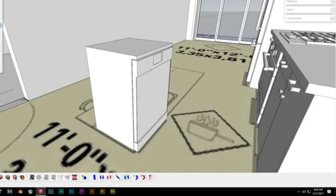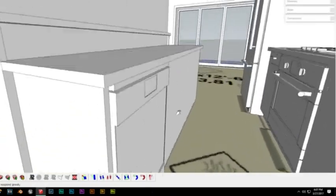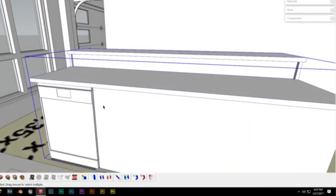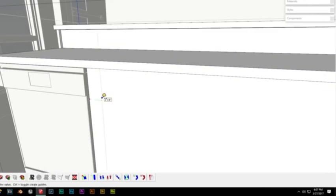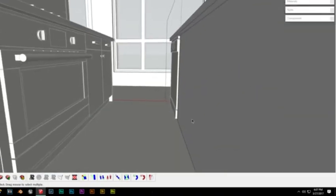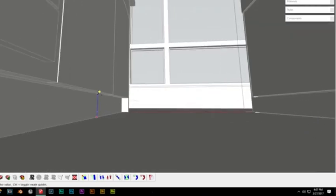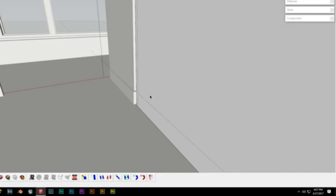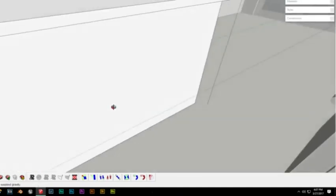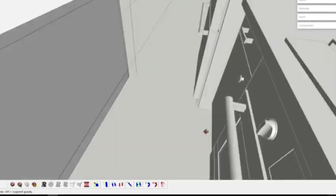So we go up to and unhide last. Then we have our counter back. And now that we have that complete, we'll go back into the counter and add in our 1 inch spacer. And then immediately we'll mirror the kick space, which I believe was 4 inches. So we'll go back in here and put in our 4 inch space, drag in 1 inch from this end, and then it went in.